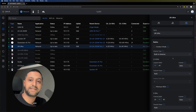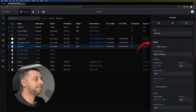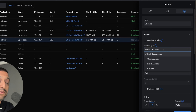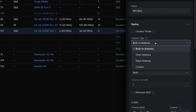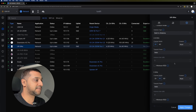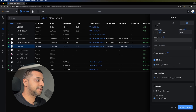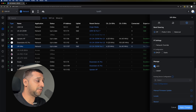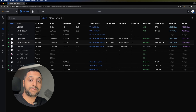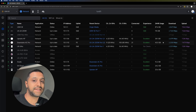Inside the Settings — which I think is the most important part — we go through the Radio option. We have the outdoor mode, which enforces your country's compliance, so if there are certain regulations you need to follow you can tick that. The big one here is the type of antenna: you have the built-in, the omni, the panel, and also a custom option. Then we have standard Wi-Fi settings such as channel, channel width, and transmit power. You can turn the LED on and off, and then there's the standard Remove, Disable, Restart, and Locate options.